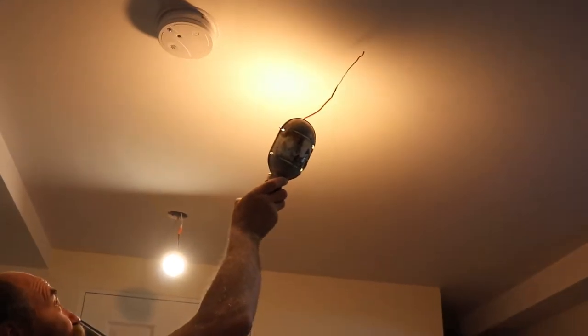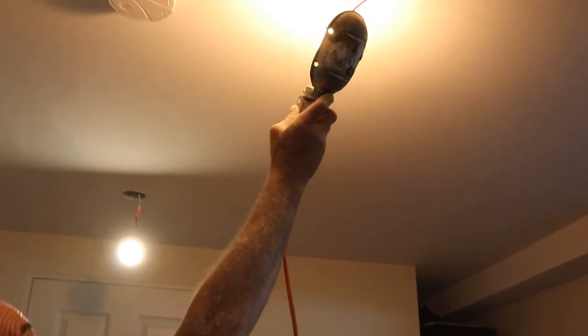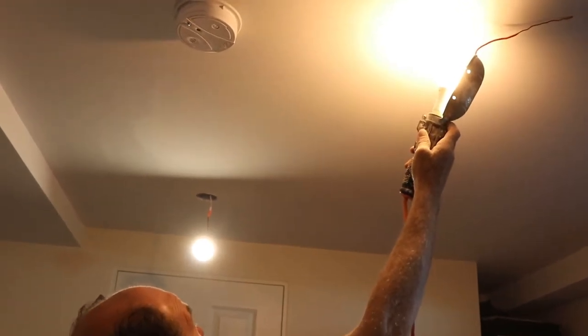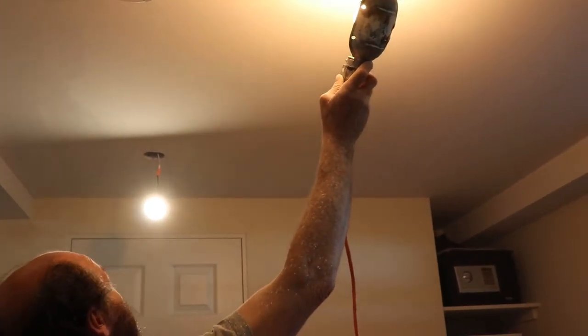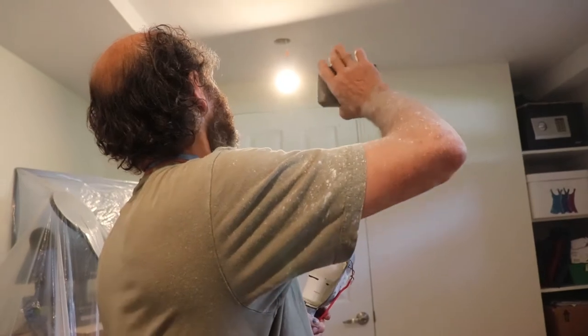As you guys can see, I just focus more on the board — you can see it's not even visible where the mud went. So this is what it's about. I'm just gonna do a little check with the sponge and go from there. Without the light you don't see where the place needs to be sanded, but once you have the light you see all the defects — going without a light would be impossible to do a good job.